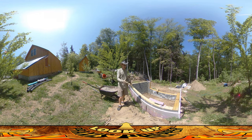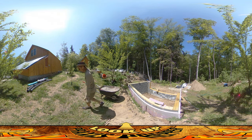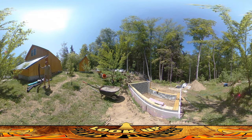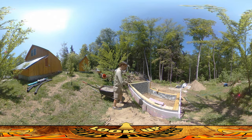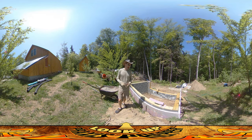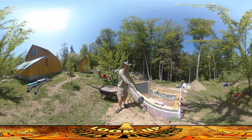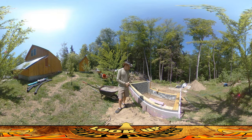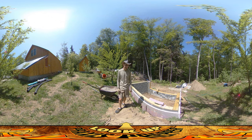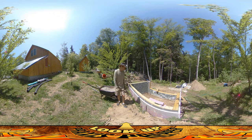The reason for that is I'm trying to create sort of a French drain kind of situation. I grabbed a bunch of this corrugated drain pipe that I've had kicking around from other projects, and I was going to do a whole drain around the outside of the foundation. But the reality is I was lazy when I was excavating and I didn't excavate it back enough to really get in and do any of that work.